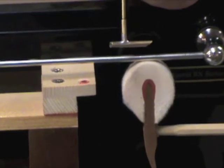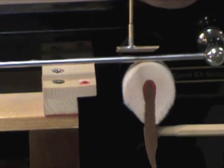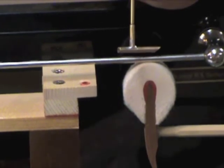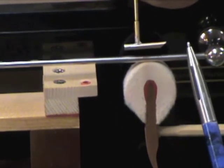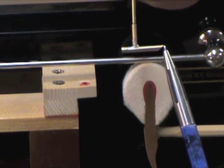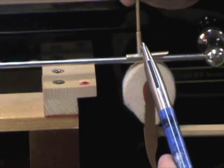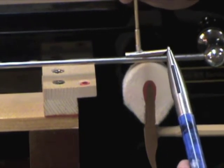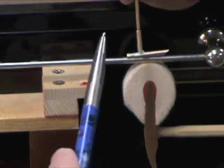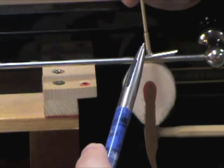Step number 9, horizontal space. Measure using taper-toed jig. The jig is laid out so that from the front edge of the toe to the front of the shaft collar is 5/8 of an inch. From the front of the toe to the back side of the shaft collar is 3/4 of an inch.